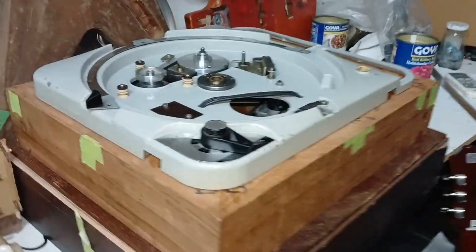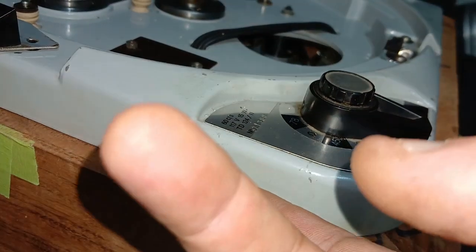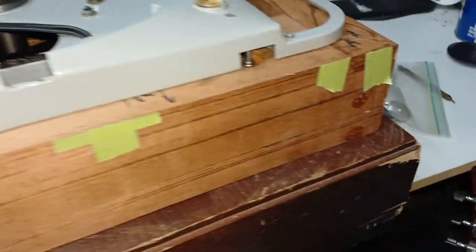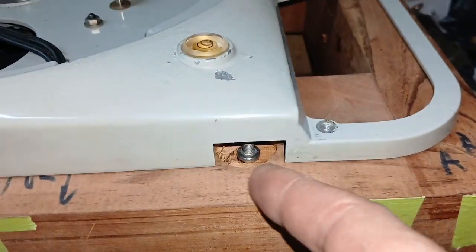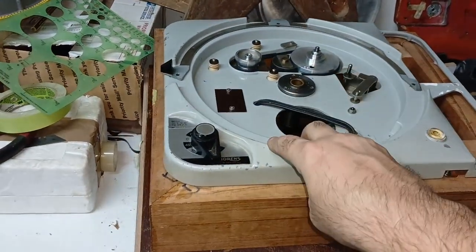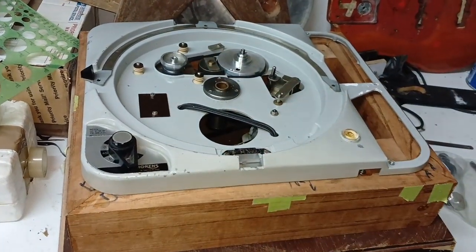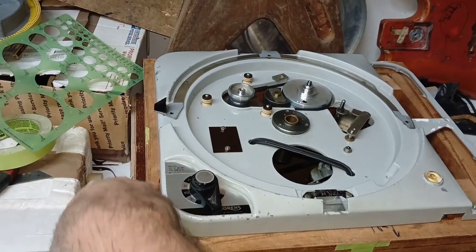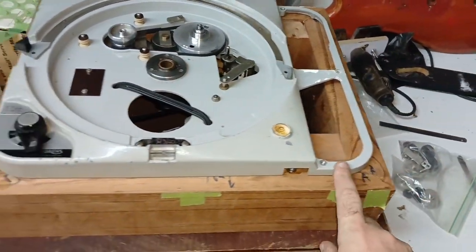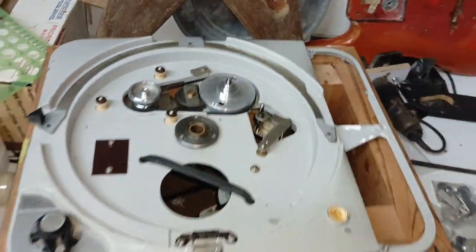It's shaping up. Okay, so I've laid it back in the plinth. All the little heads, those bolts are sitting exactly as they should, just sitting in that 3/8 hole, right? Same here. But of course, these bolts are not staying. It's sitting flush on the plinth all the way around, and nothing's touching on the inside that's not supposed to. Measuring the distance along here and along here, that's exactly even, and the distance on the front and back edges is exactly even, right?